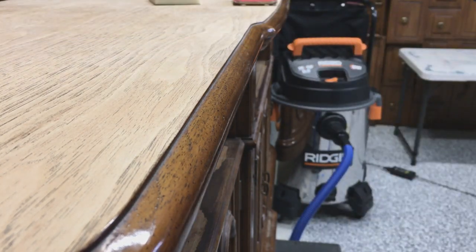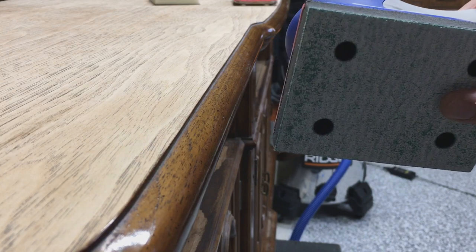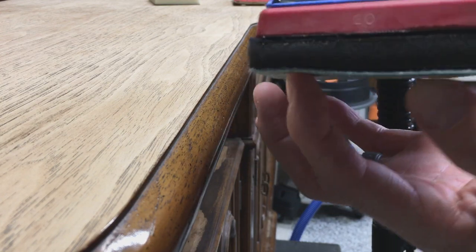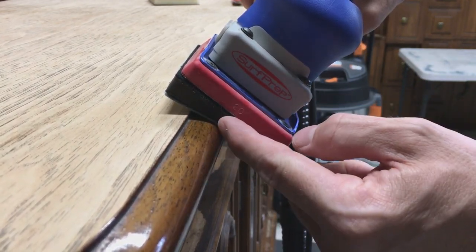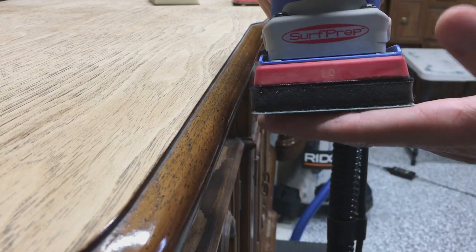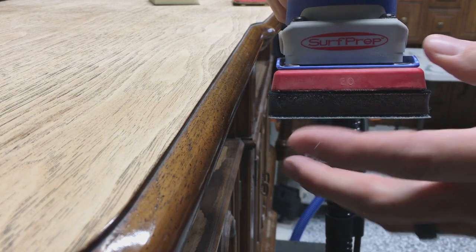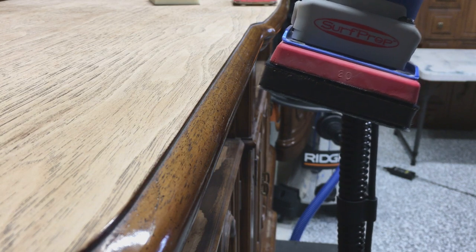Okay, so I am going to save you guys from having to hear this. I'm going to go voiceover here in a second, but I do have the interface pad and an 80 grit sanding film, and that's what we're going to do right now. I'm going to show you, it has a little bit more tension, where I wouldn't be able to hit two curved areas with this option really well. You can see how it's going to curve around this because it's a larger rounded area. But how hard the films are, how stiff these are, this wouldn't be an ideal option for all curved areas, especially areas that have multiple carving curves in them. I actually have something down below I might show you to give you an idea what I'm talking about. But this is an option for curved areas, the interface pad and any one of the grits. And then we'll move on to the sanding sponges. But I'm going to turn you off so you don't have to listen to all this noise.